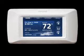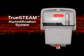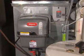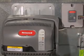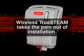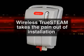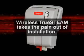It's that simple. But it doesn't stop there. If you want to provide your customer with a whole house humidification system, you can do it without wires with the new wireless TruSteam humidification system. Simply install TruSteam as you normally would, either directly to the ductwork or mount remotely. Wire the TruSteam to the wireless adapter. Regardless of the HVAC system type, brand, or model, your humidifier installation is now wired the same way each and every time — no more worrying about how to wire the humidifier to the specific HVAC panel you are installing on.